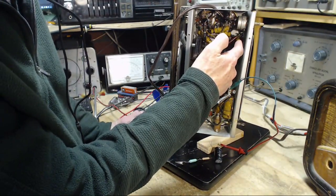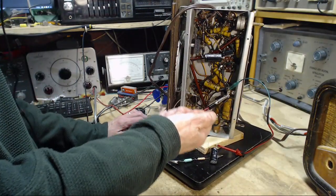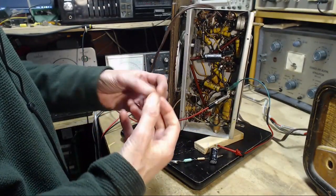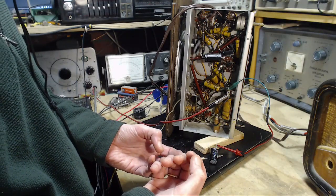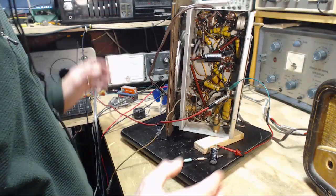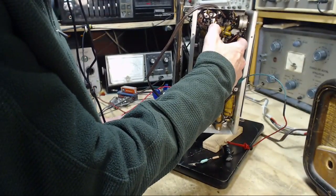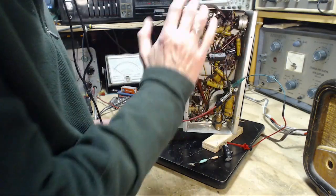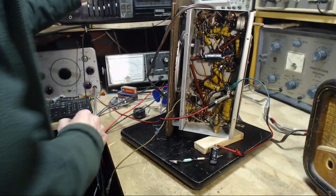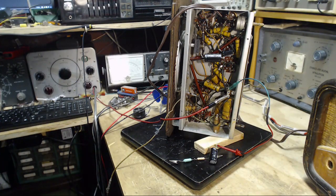It would just be basically an open circuit to that grid, and when I touched it with my probe, I'm actually reducing the impedance of that circuit point from, you know, 1 billion ohms, because it's basically open circuit. So I think that's it. I think this is the problem. I think if we change this capacitor, the whole world will change. Let's try it.